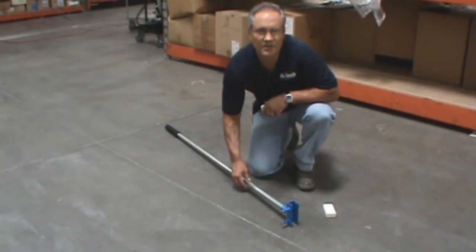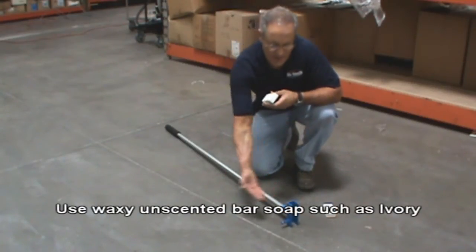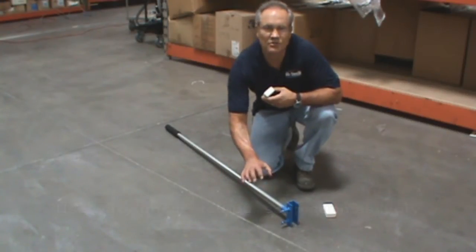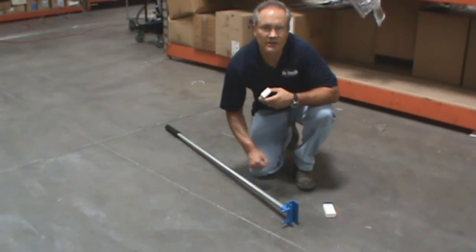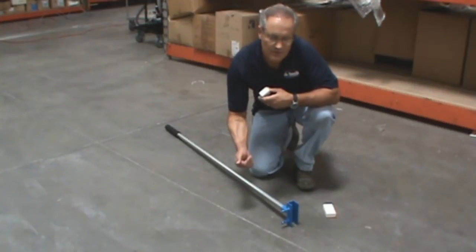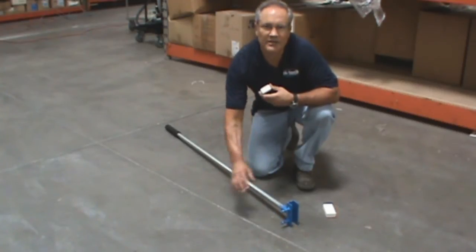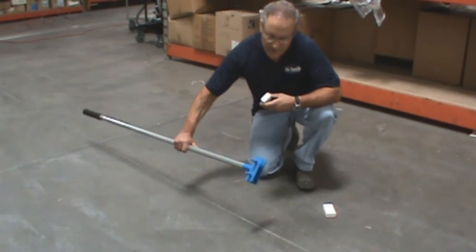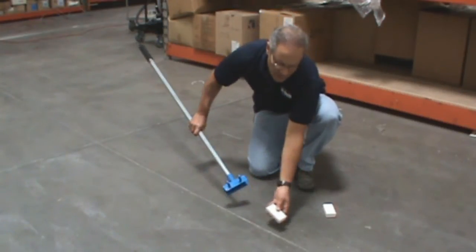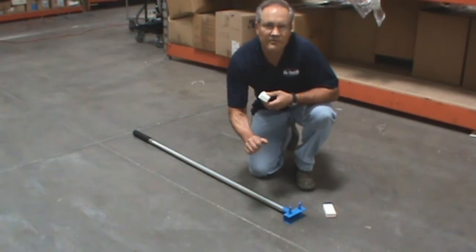To minimize the chance of a shadow on both sides of the joint, it's a good idea to use soap and rub it on both sides of the joint to form a bond breaker. So when you fill the joint, the overfill doesn't have a chance to penetrate into the concrete. This is especially important if the slab is open, if it doesn't have a densifier, or if you have a stained floor and you don't want any chance of the overfill showing up on both sides of the joint. We manufacture a soaper tool where you're able to install two pieces of soap, rub it on both sides of the joint at the same time, forming a nice easy-to-remove solid bond-breaking film.